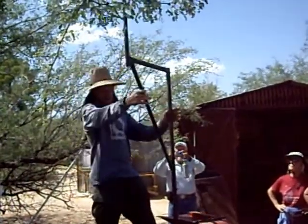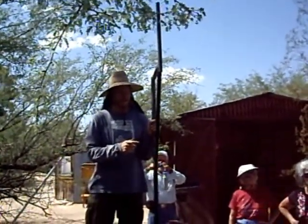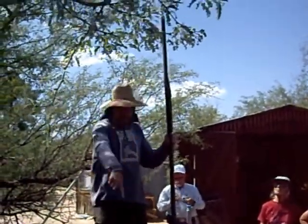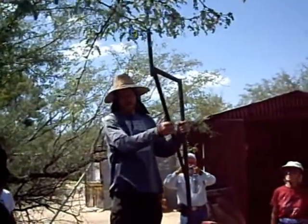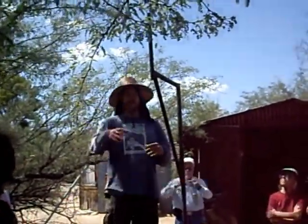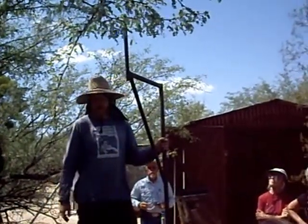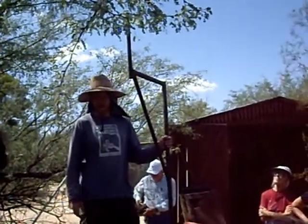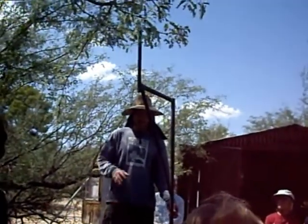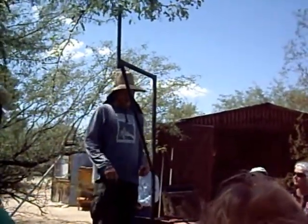Okay, you then want to swing it. Maybe it says that. Does it talk about orientation? Alright, so you swing it so it's hanging out over this, because we're going to hang the big, fat-looking duct on this, and then the garbage can's going to be underneath it, collecting it. Right? Okay, and I'm not going to tighten this down yet until we have the vat on and we know exactly where we want it. Okay, next.